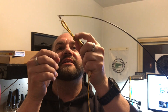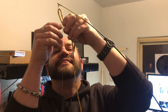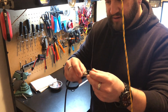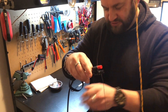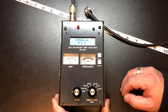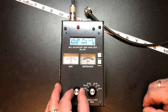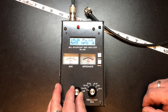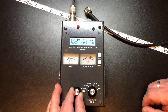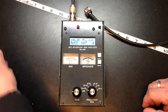I've got a little paracord here on a squid pole — I'm just going to wrap this around. We'll get some good quality RG8X, which is terrible for these frequencies, but should be all right. This is like nine feet. Let's see what we get — we'll go for two meters here. 146.5 — look at that, we're 1.4! A little low on the ohms, but wow. That's not terrible at all. It'd be a little short, but that's because it broke — about a centimeter broke. We got 1.4 on solder!